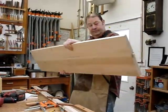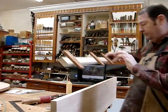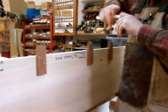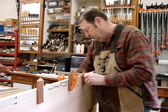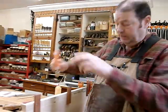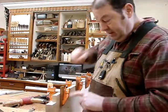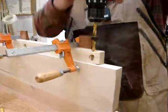Now we have our M here for male side, so we take our jig and flip it over — there's our M for male. Find our center marks and clamp it down. Get it just so. This process has a few steps, but once you get in the swing of it, it's pretty fun and it's very reliable. The jig is made out of a piece of hickory left over from an old job, and the little cleats are bubinga, but it can be any hardwood. Now drill again with the 3/8-inch bit with the stop — not the oversized bit.